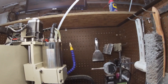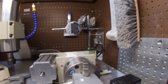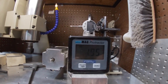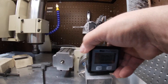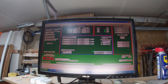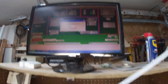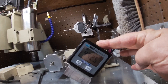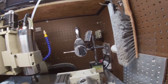Let's go back and move this back to the zero position. Now let's rerun our test — go to settings, steps per A, 45 degrees, hit OK. And we get 44.25 degrees, so we're pretty close. We can do this a few times to see if we get it dead on.